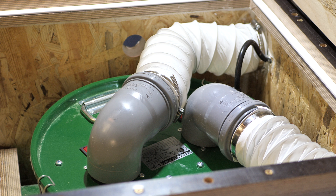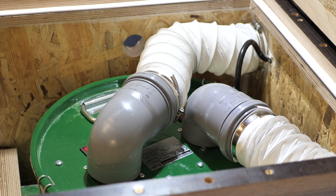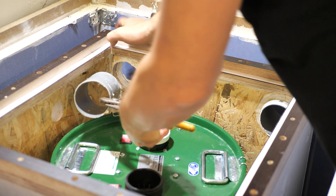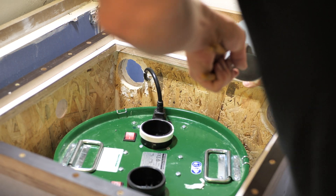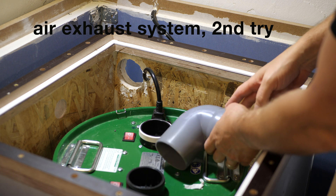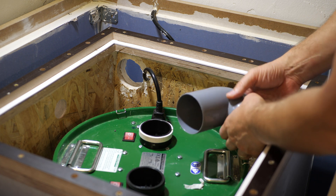This was the first time I ran into problems. This kind of hose had too much air resistance. The consequence was loss of horsepower in the vacuum system and too much leakage into the inner box. In the end I had to rip it apart again and use something with less air resistance.